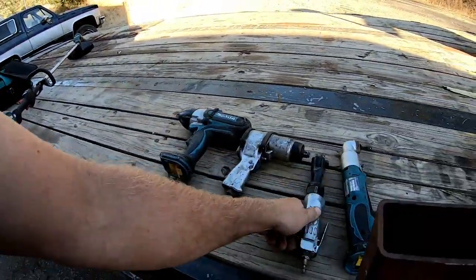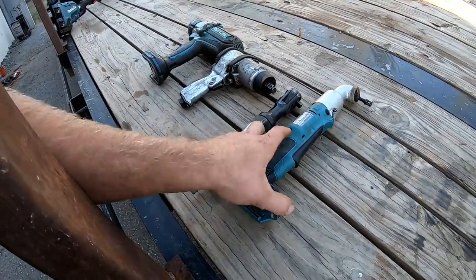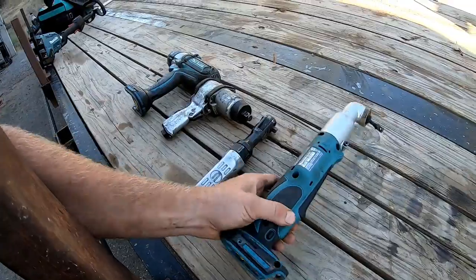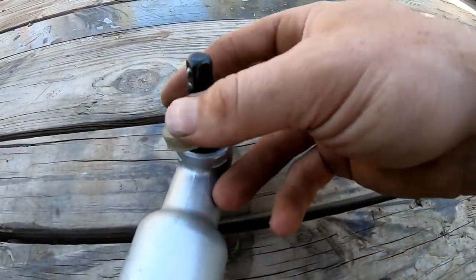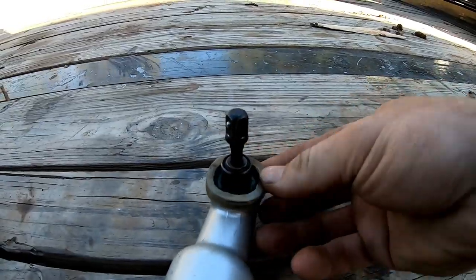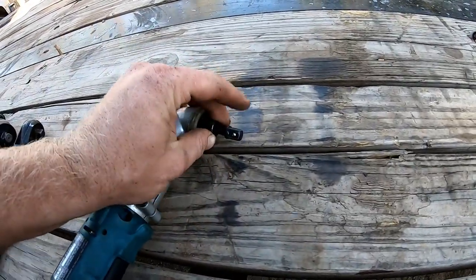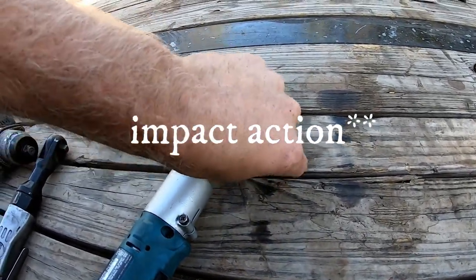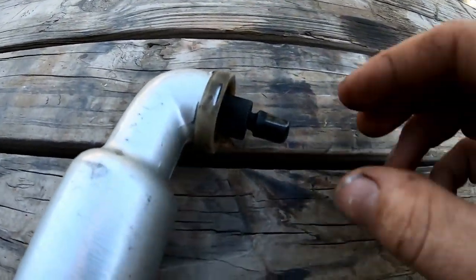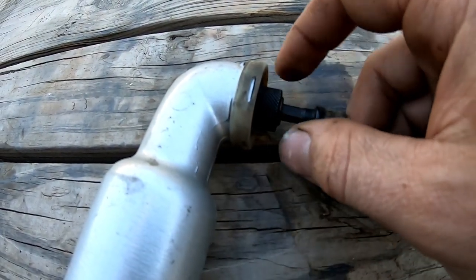Don't have to have the air ratchet anymore. It does kind of suck having a big battery on the back, but rather than have a bunch of different batteries you can get the smaller ones for these. This is so much nicer — gets into a lot of spots. I did a little research before I got this one — it's actually the screwdriver motor version so I can take the tip out. They do make a three-eighths drive but it's just three-eighths and not ratcheting from what I read. I can put different tips in there, switch it to Phillips, whatever — and I can adjust how far the tip sticks in. Sometimes you're still going to have to use a regular ratchet.